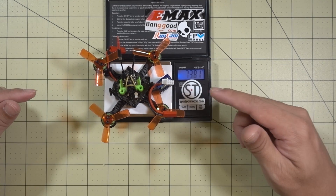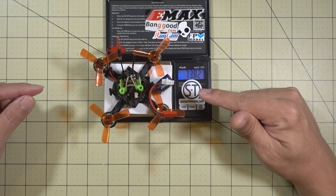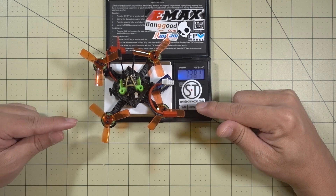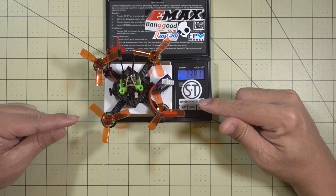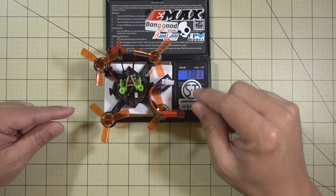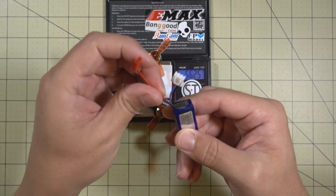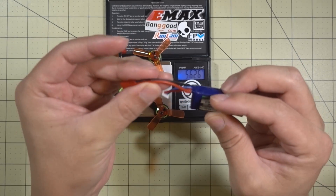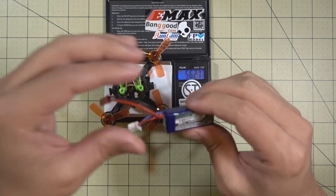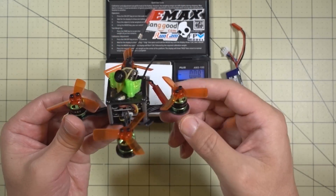I had no issues with power at this weight. If I go to something like a 500 mAh 2S battery, the weight's going to be more. I think if you go to a higher KV motor — anything higher than about 7,000 KV on an 1104, 1105, or 1106 — you'll probably have to upgrade the connector. The battery was warm but the wire wasn't, so I don't think the current draw was enough to warrant switching the connector. I just need a bigger battery so it can pump out more power.